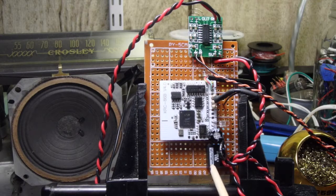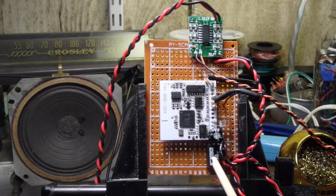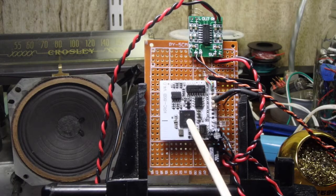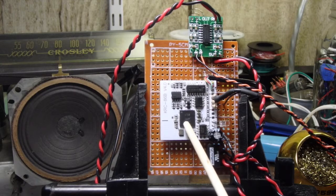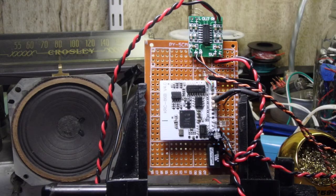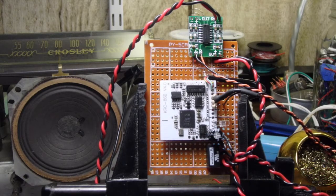5-volt also feeds this Murata DC to DC isolation transformer. So 5-volt comes out of here and through this inductor and capacitor supplies the Bluetooth board. So the only thing that this isolation transformer is running is the Bluetooth board. All right. So also out of this, we have a set of LEDs that we're going to use to replace the light bulb for the tuning dial.